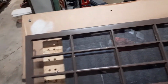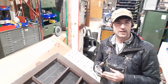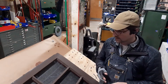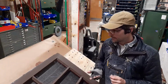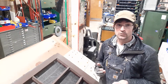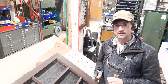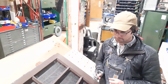So that's really about it, you guys. I mean, it's simple. It's nice. It keeps it really clean. It's a way to have really sharp corners. Painter's tape kind of has a textured or spotted line when you're taping windows, like if you're going to use a spray gun. That's what I like about hand paint application or hand brush. You get to control how much you apply. You get to have as little as you want on the glass. Sometimes if you're doing a job in the field and you don't have this much luxury of returning to cut paint, you can do it by hand and get some pretty clean lines. It just takes practice. It takes understanding the material and the situation, and I hope this is helpful for you.